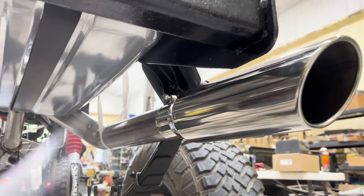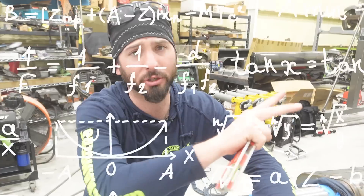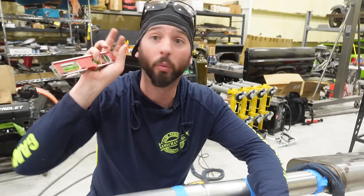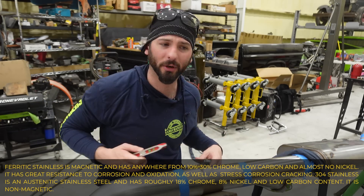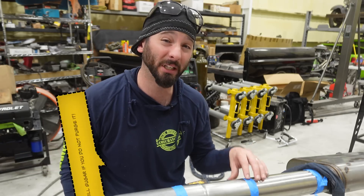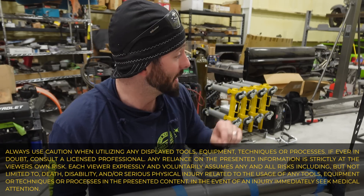To be considered stainless steel, you have to have at least 11% chromium in the steel itself. This 409 is a ferritic stainless steel — that goes down to its grain structure, body-centered cubic to face-centered cubic lattice holding the ferrite. The easy thing to tell is that it is magnetic. The 304 we have here is non-magnetic. The main thing is we still want to purge it, though for 409 appearance is secondary to its mechanical and corrosion resistance properties.